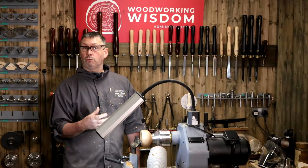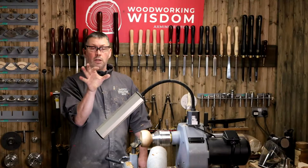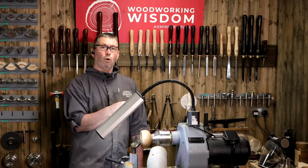So metal spikes are sometimes used in end boards. If you want to stop an end board from splitting too far up, you put a couple of metal spikes in that are joined, so they're that sort of shape, and you thump them in, that'll stop it. But stitching generally in woodturning is a decorative thing, and it just emphasizes the flaw. So turning it into a feature.